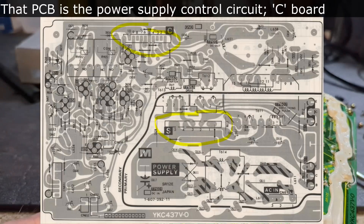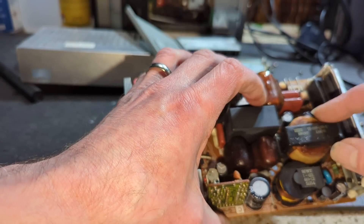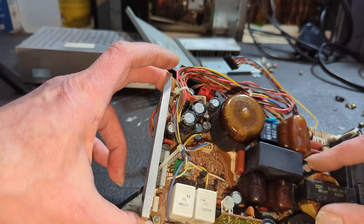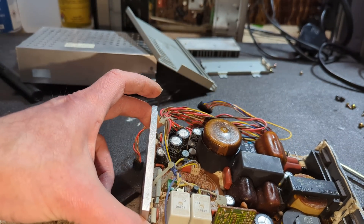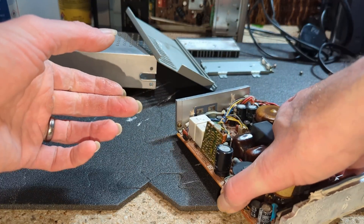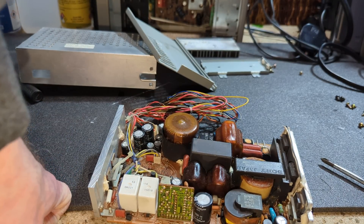It has had the capacitors changed, but it hasn't had the transistors changed, so I wonder what's happened there. 4.7 - I don't know if it was me that did this, I'm assuming it is. Although I don't know - it doesn't look like my kind of capacitor that I would fit. Those look like something cheap and nasty. The other thing that slightly gives it away that it probably wasn't me is the heatsink compound. Maybe I've done this, but those capacitors don't look like mine. Anyway, I'm going to whip them out and have a look.